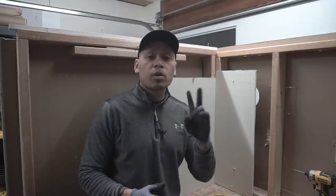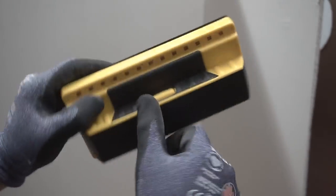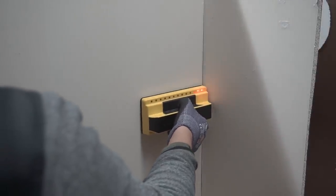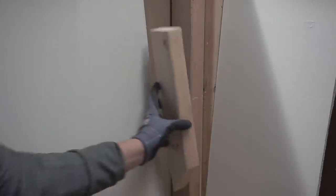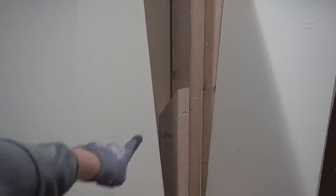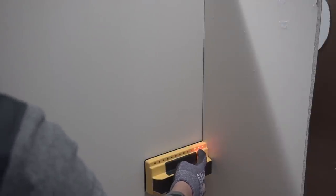I'll give you a quick rundown on two methods on how you can cut through that drywall. First off, you want to find out where your studs are located. I like to use this Franklin Stud Finder — all the tools I use on this video I'll leave in the description down below. Run your stud finder and figure out where that stud is. You can see that in this corner right here it lights up. Sometimes you're going to have studs that are doubled, just like what you see here. This Franklin Stud Finder is great at pointing out if it is a double stud — it gets thicker on the edge, so last time it had two lights, now it has three lights.